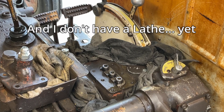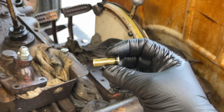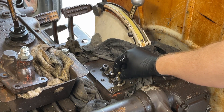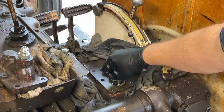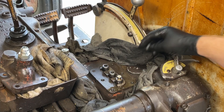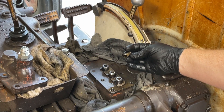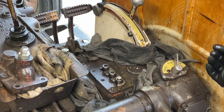I didn't want to turn down a piece of wood — I've got a hardwood dowel in my house, but I don't trust wood for this. I wanted a piece of soft metal that I could sand down to fit the hole. And then, while taking a shower, I had a bright idea: I've got brass in my house — spent casings. 38 Special Winchester. Fits like a glove down in that hole. It's about two thousandths less than the width of that hole — slides in there perfectly.